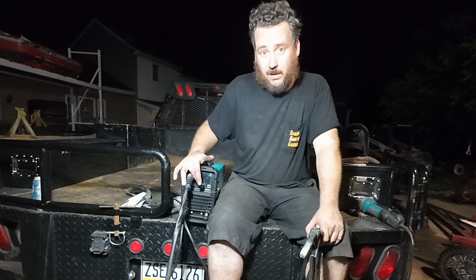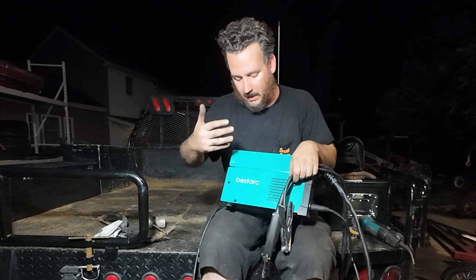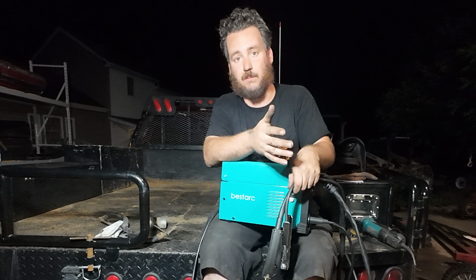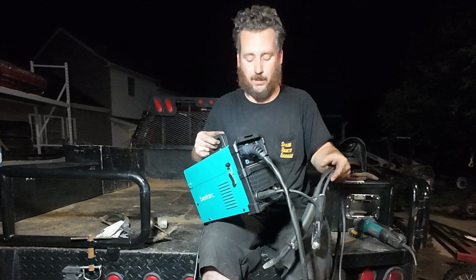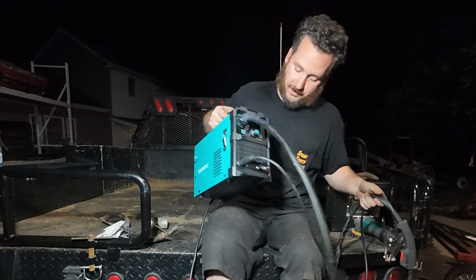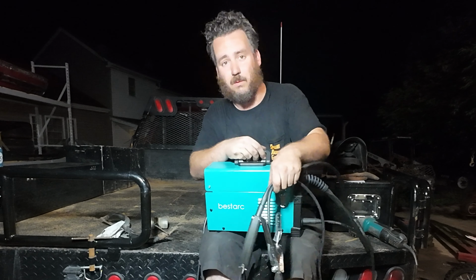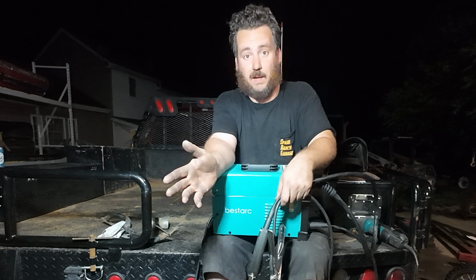It's my first time using a single knob MIG welder. I burned almost the full 2-pound spool that comes with this without issue. When I'm working with this welder, I keep it up in harm's way intentionally just to test it because in a fabrication environment, you're shooting sparks, slag, grinding, cutting, whatever, in proximity to the welder. Whether you should be or shouldn't be is one thing, but in reality, that's just what happens. I was shooting sparks directly at this thing, and there's nicks on the screen, but it didn't suck anything in, it didn't short itself out, no issues with that. I wasn't particularly gentle with it, and it took everything I threw at it. I wasn't out of control with it, but I was trying to be realistic to what you'd see for a cheap welder and somebody just out there not giving a crap.